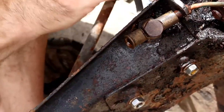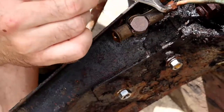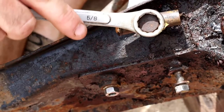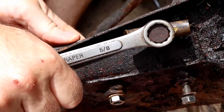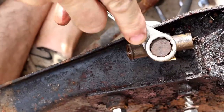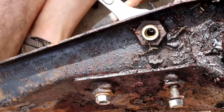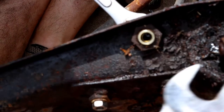Once I've done those, I'll take the flexi off and probably this copper fitting here, because that's a nice fitting and I know they're quite a lot of money. To take this fitting off, I've had to support the flexi underneath; otherwise it turns. Just undo this top bit here — tight one. That will release this lovely fitting. And while I'm there, I'll also undo this nut here. You have to hold the underside. I think that nut was 15 sixteenths — that wasn't overly tight.